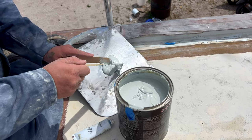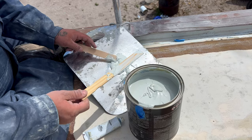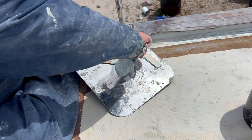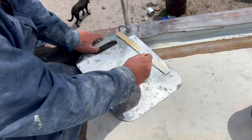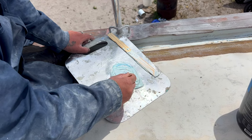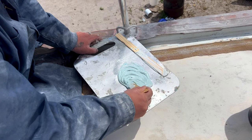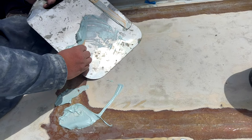Got to mix it really good, because there gets this oil in the bottom of the can when you first open it. You got to mix that up. And then the hardener — you just want kind of a smiley face, well an even line, with the amount that you have on your mixing plate or jug or whatever you're doing. Then you're looking for a consistent color — I kind of aim for a baby blue. Does that make sense? Consistency in your color, make sure it's all well mixed.